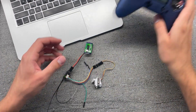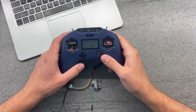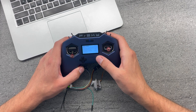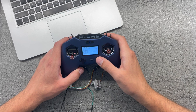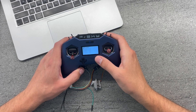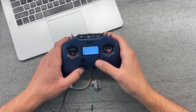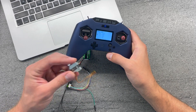Now when it's done, you can see my servo is not moving. Once it's wired up, let's discover telemetry sensors — let's scroll to the telemetry screen. I've got some sensors already, so let's delete all of these and discover new ones. As you can see, alongside the regular sensors we usually get from the receiver, we also got Servo A, Servo B, Servo T, and Servo S. Those are the actual sensors which are coming from our servo.